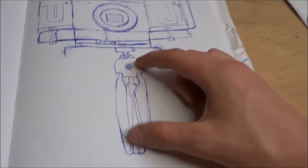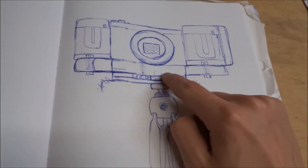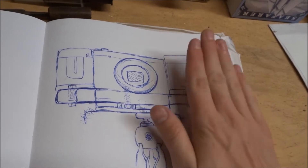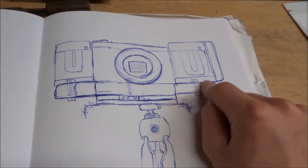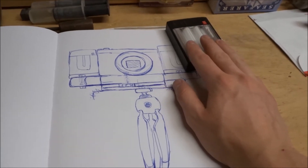So here we have it right here — this is the Manfrotto tripod piece that I use. Basically I'm making a block that attaches to the bottom of the camera, and this can then attach to that. This block has some arms on either side that I can swivel the lights on. I can tighten this little nut down and have this light face this way, or at an angle. They can turn. So I need to glue a piece of wood to the bottom of this on either side, and that's the first thing I should be doing because I need time for this to dry. I'm going to be using this 90-second epoxy to hold that on.